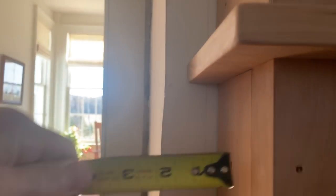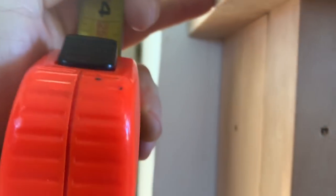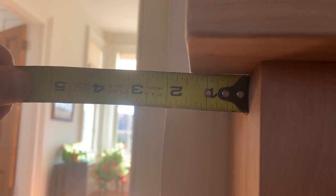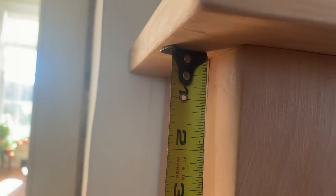Now down here, these are sticking out about 1 1/2 inches. So if I do 1 1/2 inches on it, it's gonna look funny because it's gonna be coming straight into the roundover and that won't look good. I need this dimension to be about 1 1/4 inches, maybe even a little bit less. And then this dimension, I can maintain 1 1/2 inches. So how are we gonna do that when all I have is 1 1/2 inches roundover bit?